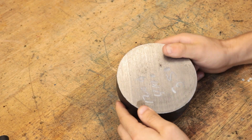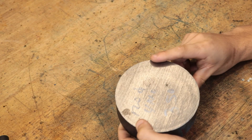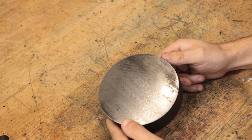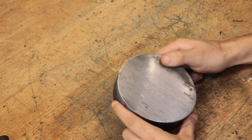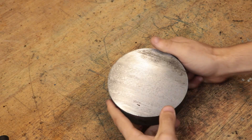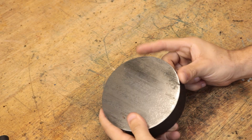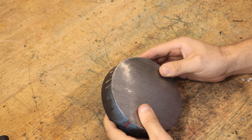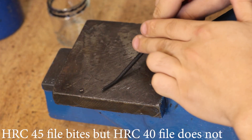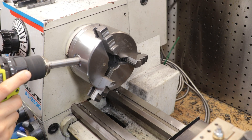For a bench block, that's a bit more than I can afford, so I'm going to attempt to make it myself. I've had this piece of 4140 offcut in the workshop for the past year. 4140 is high-tensile chromoly steel, and while it probably wouldn't be my first choice for this project, getting large-diameter blanks of tool steel in this size isn't easy. If I heat treat it properly, I should be able to get it into the mid-to-high 50s Rockwell C hardness — the current anvil is only about 40–45 Rockwell C, so once tempered back it should be plenty tough enough.